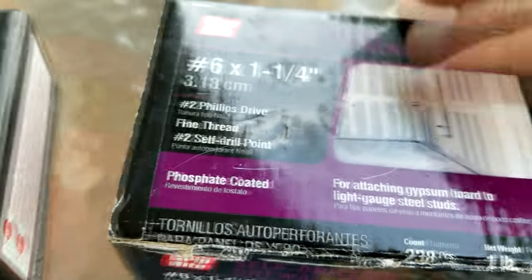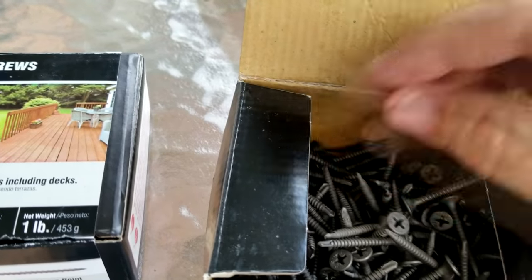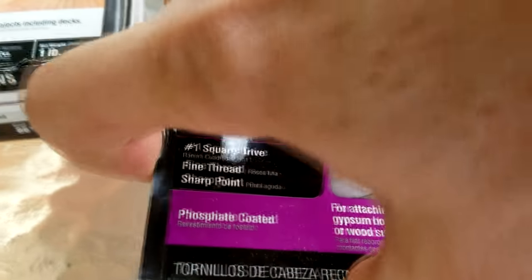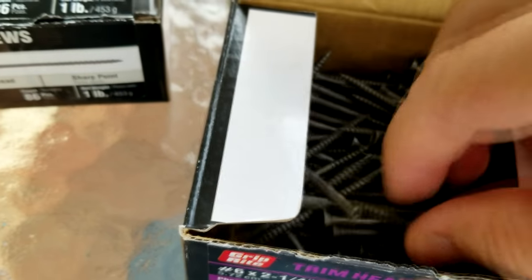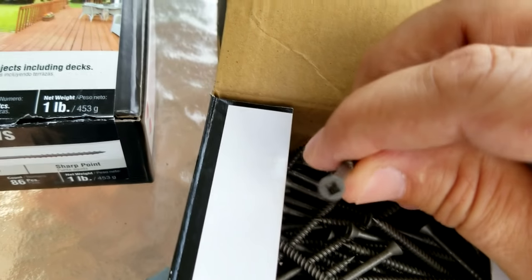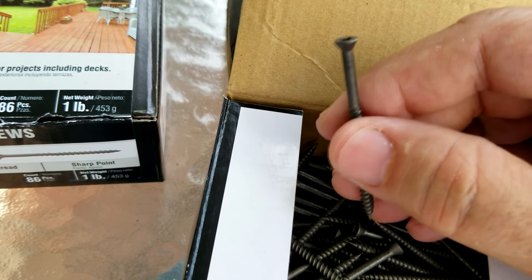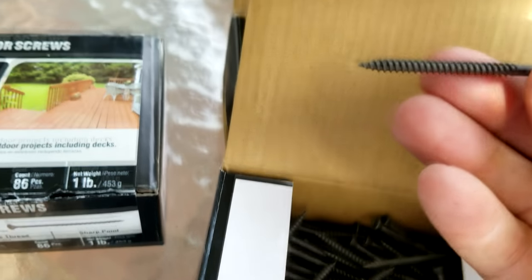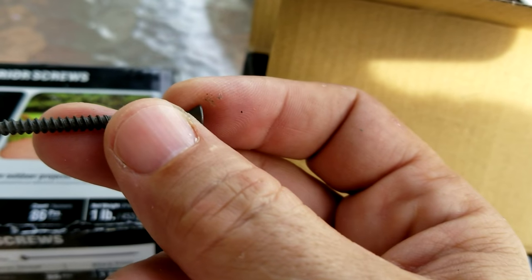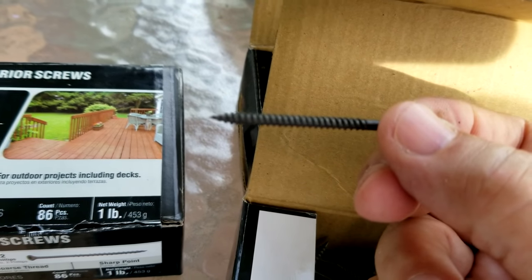The small ones don't have much use — it's the bigger one I use here, and I like it because it has a square drive and fine thread. See how small and low-profile that head is? With a square drive, you use a square bit instead of a Phillips head bit and it never slips out. These low-profile heads are appropriate for going sideways through the frame of your cabinet into the cabinet next to it, tying them both together.